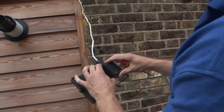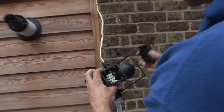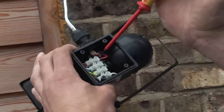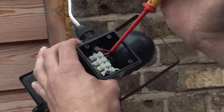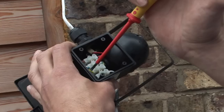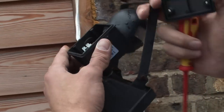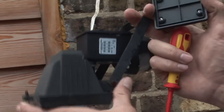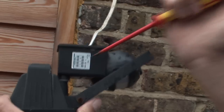Take a closer look at the connections — unscrew the waterproof lid which is there. Have a look at the cable itself: it's connected to live, which is the red or nowadays will be the brown, the neutral there, and the earth which is there. They'll just match up to their connections on the other side, but with most lights — outdoor ones anyway — it'll give you the connections on the side, so as long as you follow that you should be just fine.